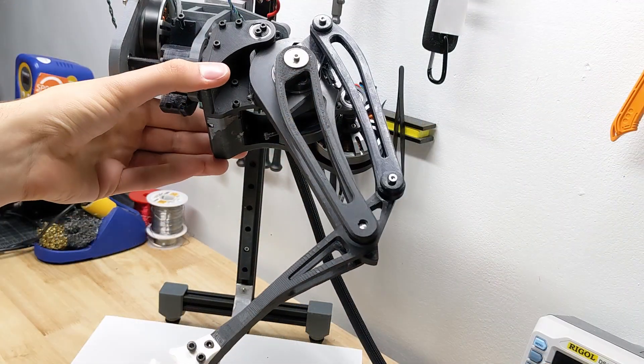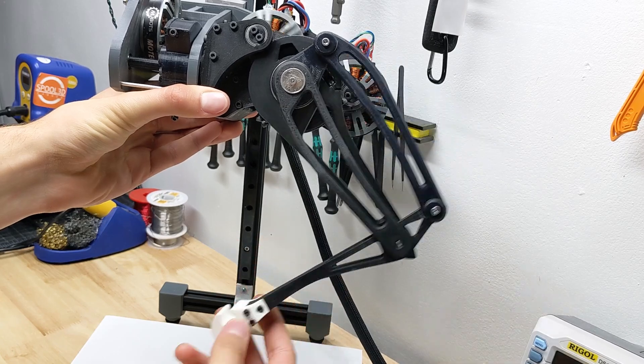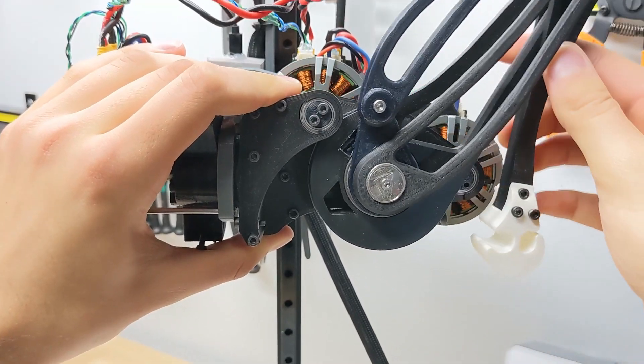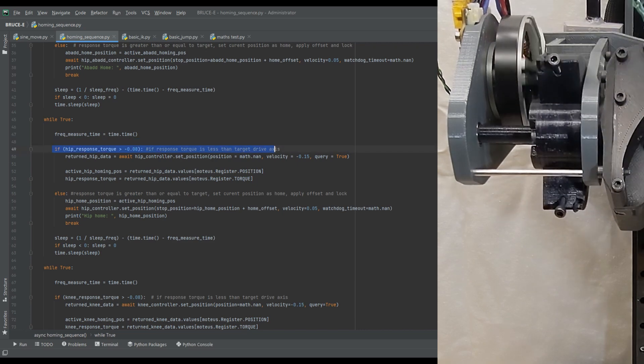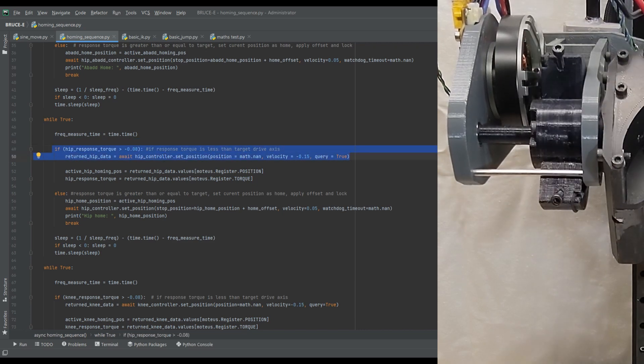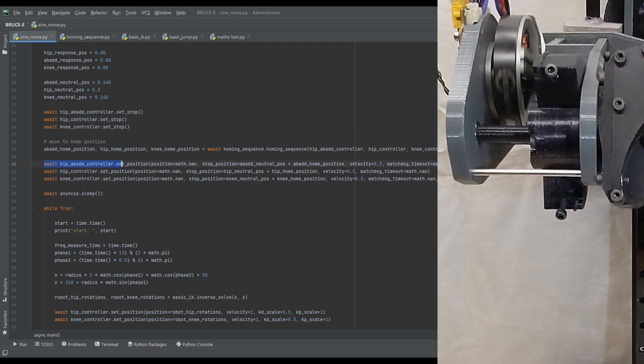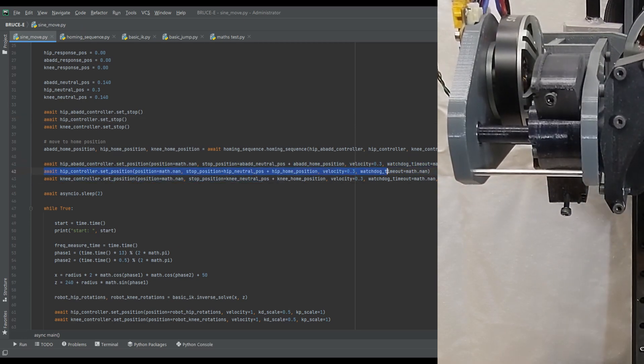Now that some simple kinematics are in order, I'd like to try something a little more interesting and dynamic. I'd like the hip abduction-adduction axis to remain still at a neutral home position along the Y axis, and I want the foot to follow a trajectory of some sort along X and Z. To orient the leg in known space and align the software with the hardware, I first wrote a small homing sequence. This bit of code is intended to home the axes against physical end stops — those being this aluminum post for the abduction-adduction axis, and the travel limits of the knee and hip respectively, and the leg's fully retracted position. This script works by driving an axis slowly and indefinitely with a low maximum torque cutoff. The instant the axis collides with an end stop, the controller senses that the motor current has exceeded some threshold, holds position, and marks that last index position as zero. It then advances that axis in the other direction to my specified home position. The script then repeats this process with the other two axes, and now they all know where they are.